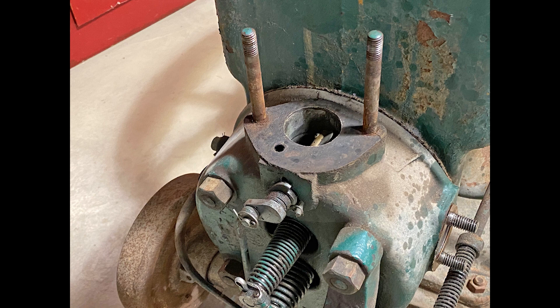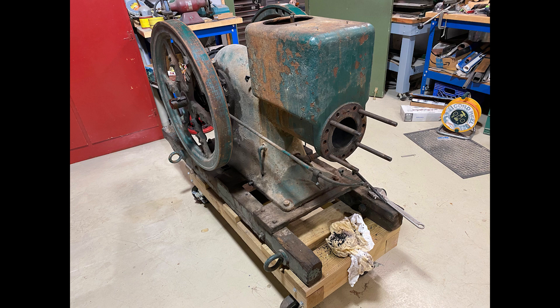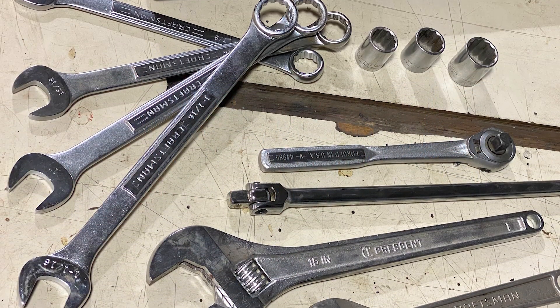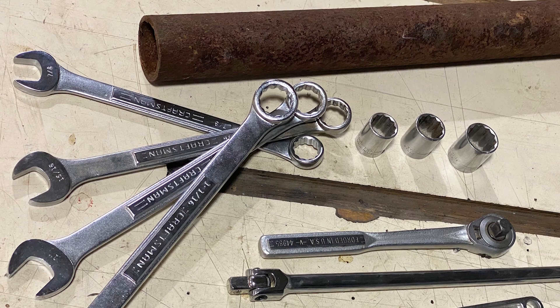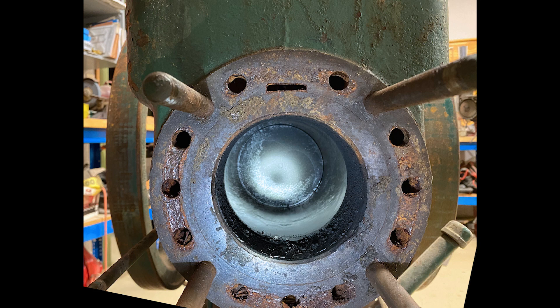I first took off the mixer — the studs were just too tight to remove. Next I removed the igniter. Note the brass gaskets; these are extremely important as I'll explain later when we talk about the magneto. Here's the front of the engine with the head removed. You'll need at least a half-inch drive ratchet and up to one and one-sixteenth inch sockets and combination wrenches, as well as a piece of two-inch pipe for leverage and persuasion. Looking inside the cylinder sleeve, we see a lot of carbon deposit at the top end, but fortunately no scoring of the cylinder wall.